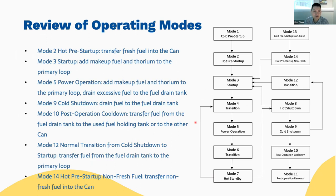Adding fuel step by step helps us maintain excess fissile material in the core to a minimal level. Because we're adding new fissile material, we have to drain excessive fuel to keep the volume of fuel at a relatively constant value - that happens in mode five. In mode nine during cold shutdown, we drain all the fuel from the primary loop to the fuel drain tank. In mode ten, we transfer fuel out of the fuel drain tank to either a used fuel holding tank, another can if the fuel can still be used, or back to the primary loop if we're reusing it in the same can.